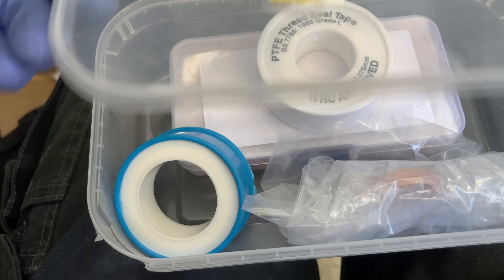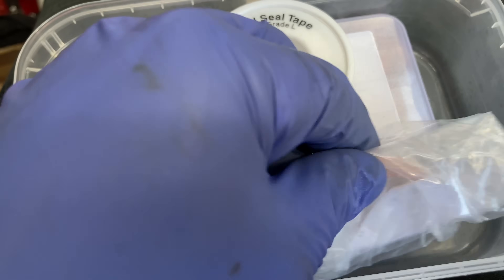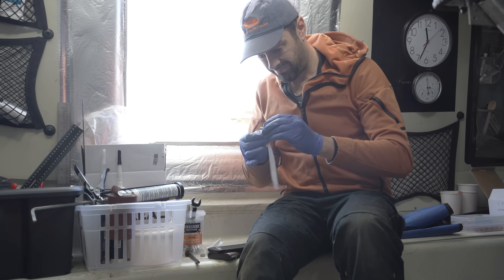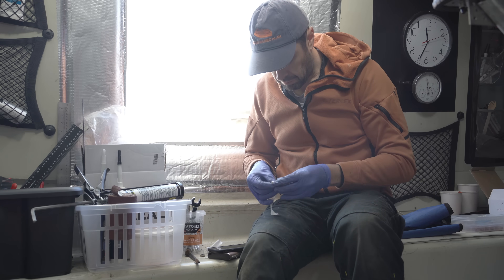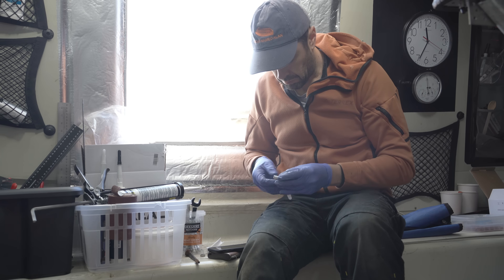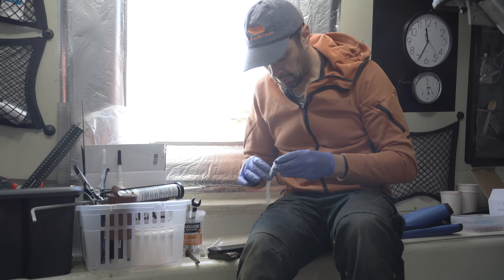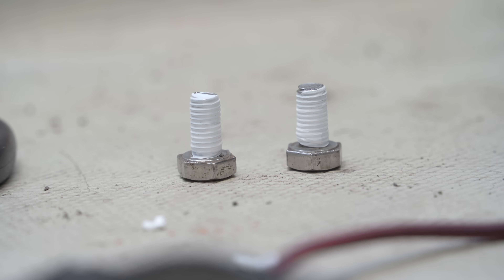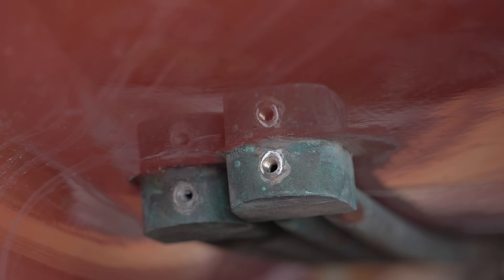I'm no more a plumber than I am a sailor, but I'm sure that I can do the taping and the final seal to a good standard. You go clockwise with a PTFE tape, so it doesn't unwind when you screw the bolt in, and it was going to be guesswork as to how many turns. Too few, and it won't work, but too many, and you may clog the thread, jamming the whole thing up. I had a couple of false starts, but eventually got it right. The seal is all inside the thread.